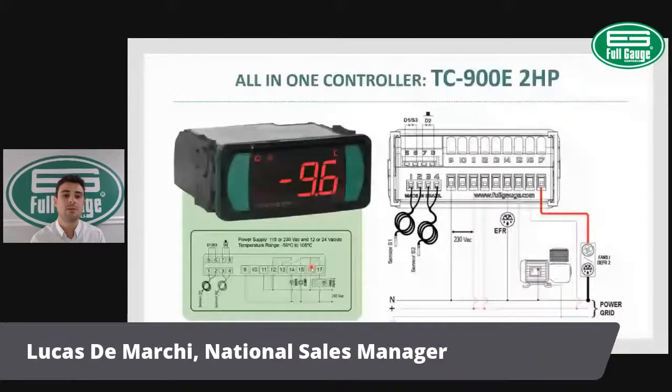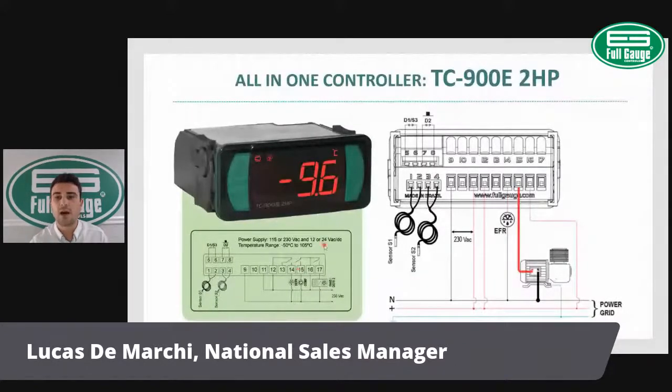So that's having an independent common. Once we have this, let's move to the next wiring diagram, where I would like to share with you how the compressor and defrost are wired. Here we have 220 from the controller to terminals 9 and 11, and we are feeding another hot line to terminal 12 in order to energize the defrost circuit.